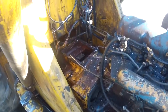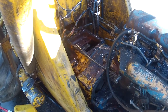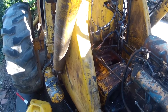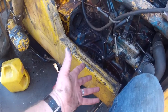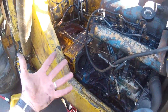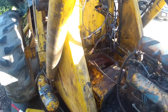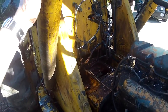I think we're to the point where we've got shimmed wheels, got things supported. This afternoon I'm going to try to get those bolts out of the torque converter — there are eight of them if the service manual is correct — and then try to get this thing separated. Probably the best method is to put a rolling floor jack under the engine with a piece of wood under the oil pan, get everything unbolted, then put a guy on each front tire and start pushing to shimmy them apart. I'll take that goofy 20-year-old son of mine when he's here tomorrow morning and put him to work.